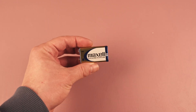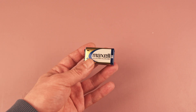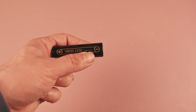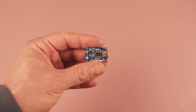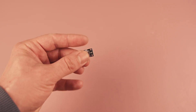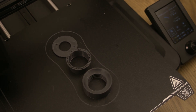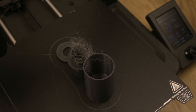If you want to use batteries to power this preamp, I recommend using a 9V battery — they provide clean current so they won't interfere with the audio signals as much. Another option would be lithium-ion batteries, but they only provide up to 3.7V, so you'd need a lithium-ion charger along with a step-up board. However, you may want to shield the voltage regulator and step-up converter as some of them can introduce too much noise into the circuitry. Now we need a casing for the microphone, so I designed one and 3D printed it using my 3D printer.